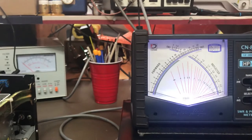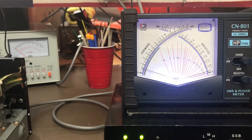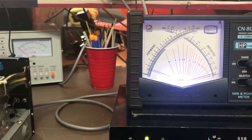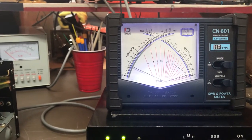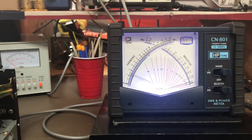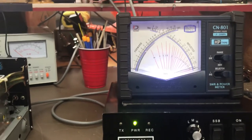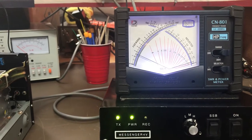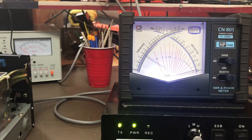On medium - my dog wants to talk on the radio too sometimes. On low the dead key audio jumps up to about 600, and on high audio hits 725 out of it. It could easily be made to do a thousand watts, but audio is king, not power. Dead key to audio easily 700 out of it.